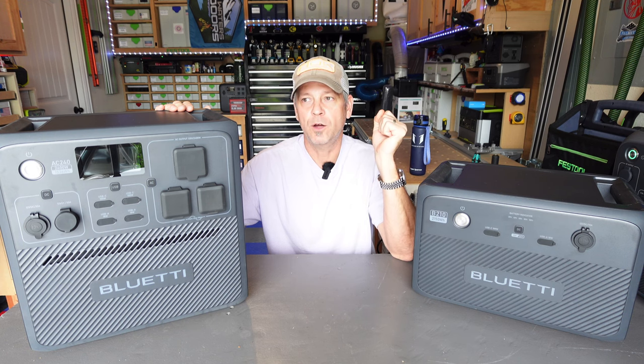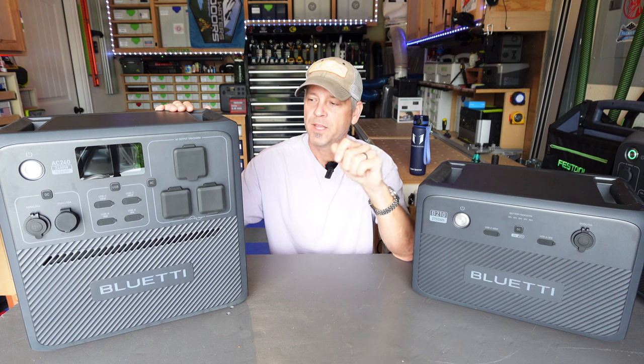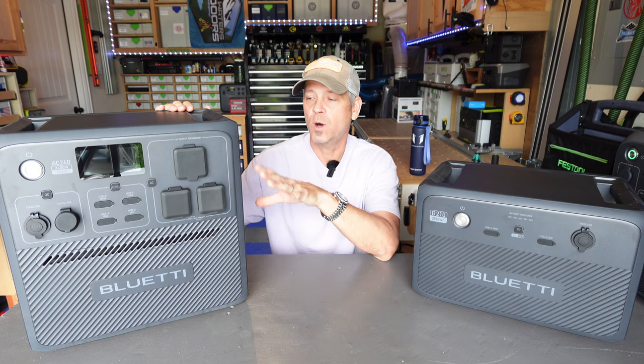You can turn on power lifting up to 3600 watts. What that does is, after you reach 2400 watts of output, it's going to decrease the voltage on whatever device you're powering to enable it to keep running. I don't particularly recommend doing that unless you're running something like a hot plate or a heating element that doesn't require a steady 110 or 120 volt output.